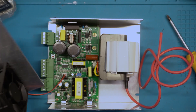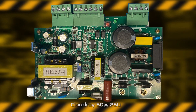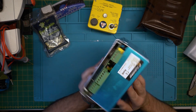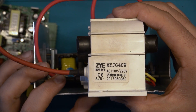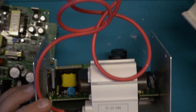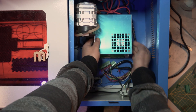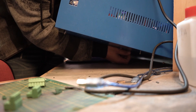At first view we have the exact same PCB — even the numberings are identical. But it seems there has been some kind of quality control. The caps look a little bit higher in quality. The only significant difference is the flyback transformer: it's the same brand, but obviously more powerful, putting out 50 watts instead of 40. I'm curious if this improves the cutting rate, as I only measured 38 watts maximum output on my machine. As the PCB layout is exactly the same, it should be as easy as plugging back in all the Molex connectors, hooking up the high voltage line with those specialty insulated screw connectors, and giving it a test run.